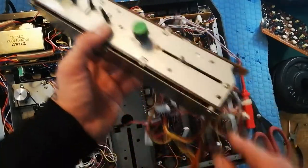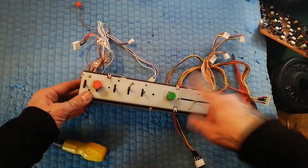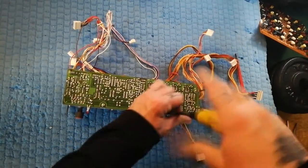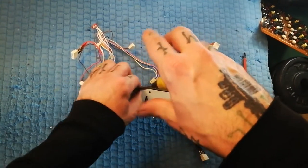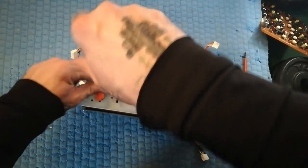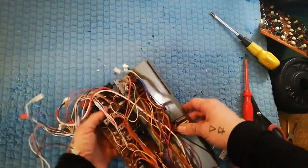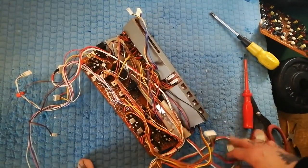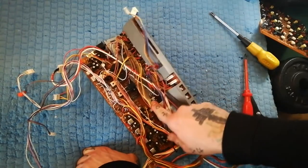We've got the playback board. I'm going to remove these two screws. Additionally, there are screws here that need to come out — they're attached to the base of these two switches, with a plastic spacer between each one. Do this on top of a towel so you can catch those spacers. At this point we've got a mess of wires, but we have access to the bus headphone pot and the auxiliary master pot for cleaning.